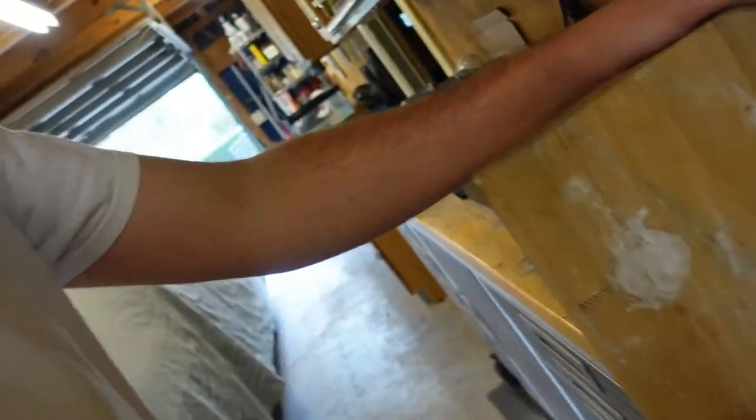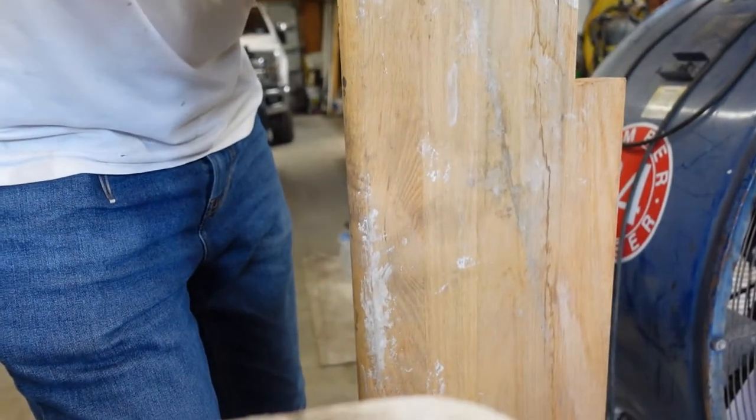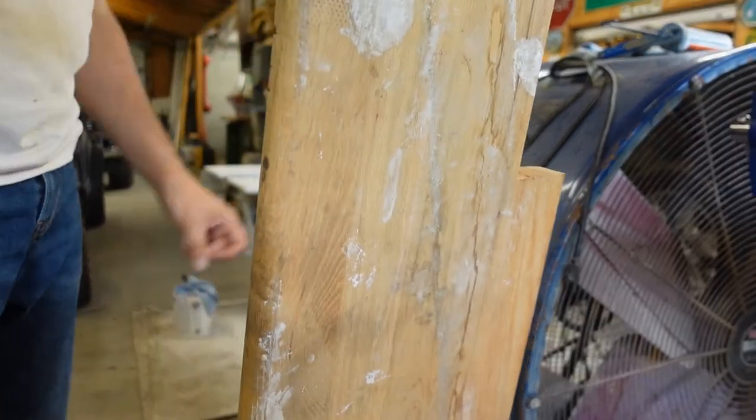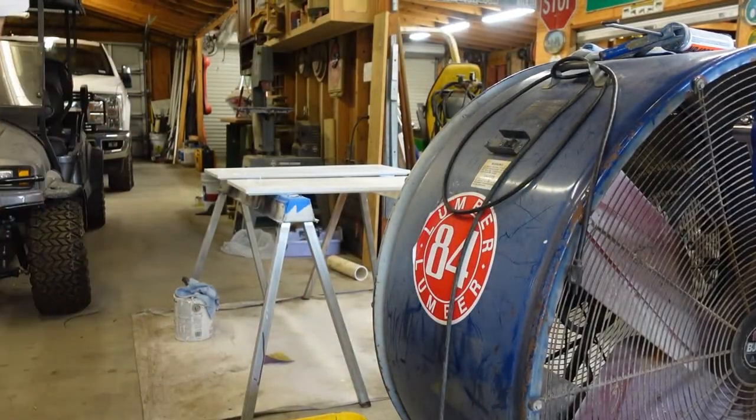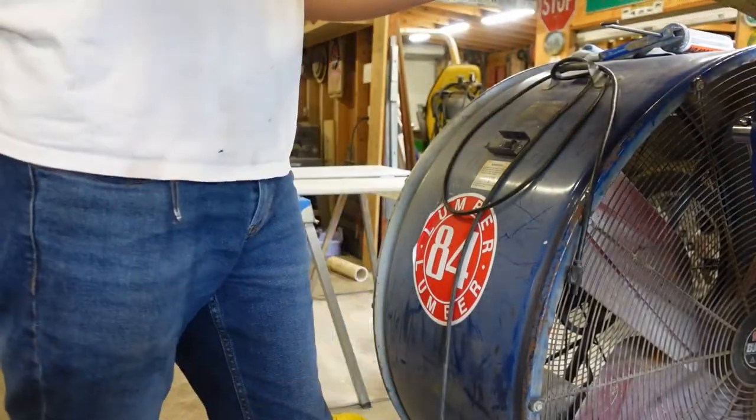And we have this piece of oak here, or pieces of oak that used to be a shelf. And I'm thinking that looks just thick enough to make for a decent handle, you know? So first thing I'm going to do before I go work on that guard is put this oak on a table. I'm going to finish a bit of it the way I finish all of my handles: sand it to a rough 220 grit, then give it a quick burn with the torch, and I'll linseed oil it and see how it looks. Get to that then.